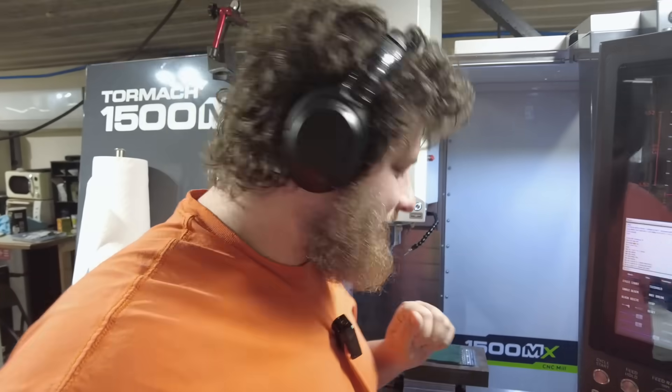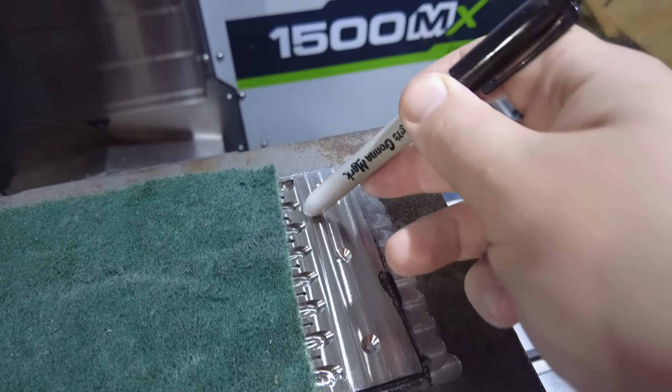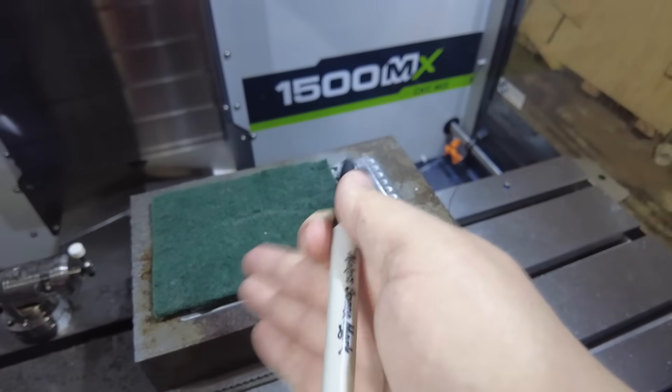It is the next day now and I've made quite a bit of progress. My end mills that I purchased for this job came in. While these aren't traditional hard milling end mills, they're definitely better than what I was using. The big game changer is these eighth-inch five-flute bullnose end mills. I was able to change over some features I was milling with a 1/16th inch end mill and switch them to those, reducing my cycle time by about two hours per part — and I have 18 of these to do. I was also able to resurface features and countersinks with the bullnose, leaving better finishes and saving about five minutes per countersink, with five more countersinks on the other side.